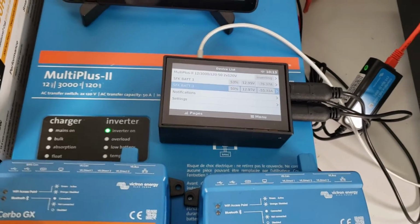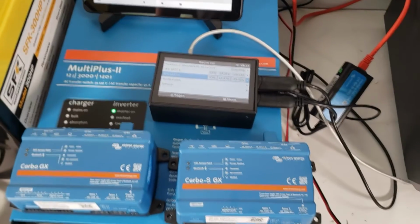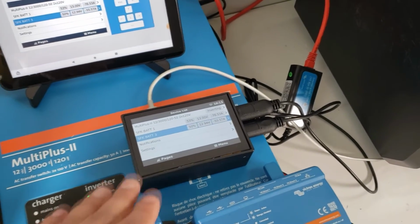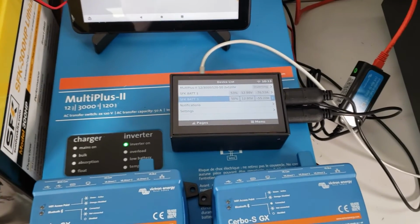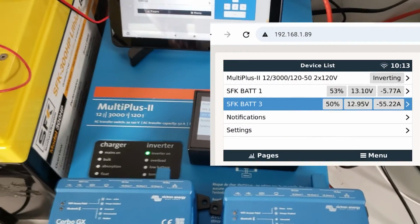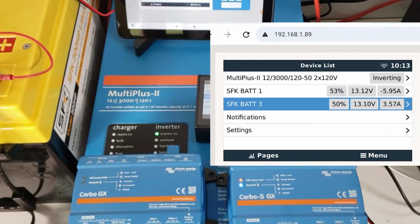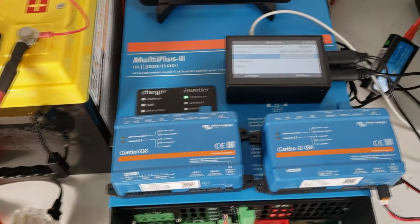But generally, if you are only using two devices, such as the inverter and solar charge controller, and need them to communicate, the Victron running Venus OS on the Raspberry Pi may be an attractive option for you. But all of them work, and all of them have their advantages. So decide which one you may want to do. However, our driver should work with all of these devices, and you should have no problem getting it running. And again, we support up to 8 batteries. So if you need to attach a small USB hub so you can attach more batteries, you can. But this should just work.